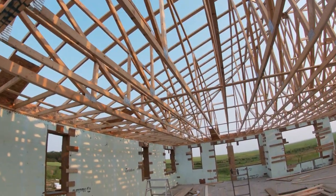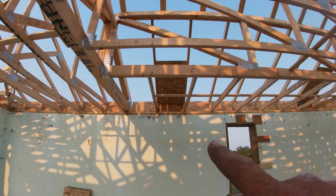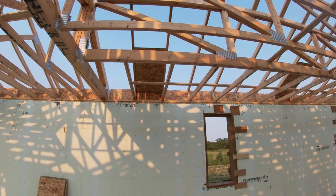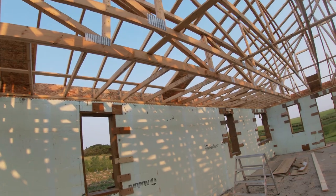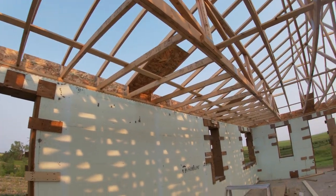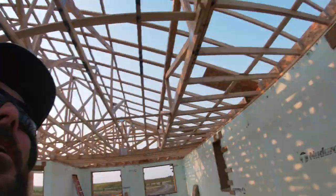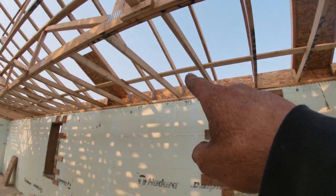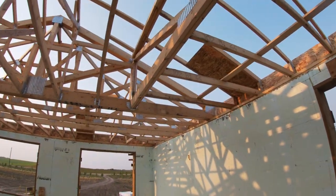Yeah, so here's the roof on the inside. Guys are doing an awesome job. I really like how they're doing the insulation stops. A lot of times the guys actually sent me these cardboard ones, but Ed kind of talked us out of them. He says if you get a real strong wind, they're just hammer stapled on there, so it could pull them off and then they'll just be flapping around up in there. So he builds them this way, closes them all off, but leaves these spaces every so often for the air to get up into the attic and ventilate correctly.